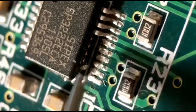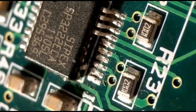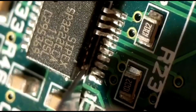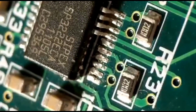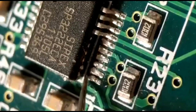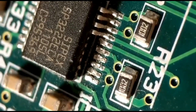This last little bit looks a bit more fiddly, so I'm going to get a scalpel on that and gently cut through that last one just to expose a little bit of copper. There you go — chip that off. So you've now got six little bits of copper exposed. I'm just going to wick off all the excess solder on the pads and then give it a cleanup, and you've got a basis for a rebuild. I'll put a little bit of flux on the pads.